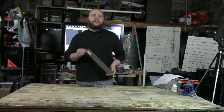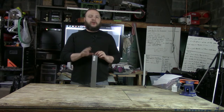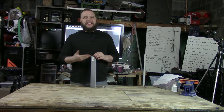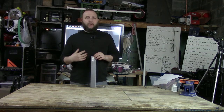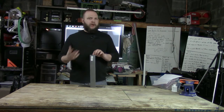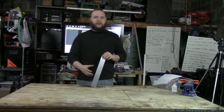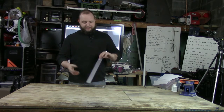The knife in this series is going to be made out of 1095 steel. Now we chose 1095 for a couple of reasons. First being ease of machinability on our end. We don't have to use a death wheel on a grinder or anything like that. We can use the portaband. It's easy to cut out, this being a stock removal knife.